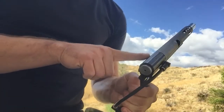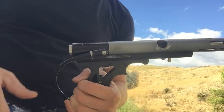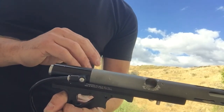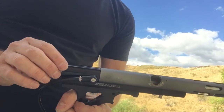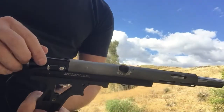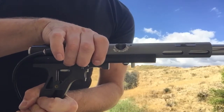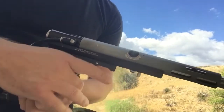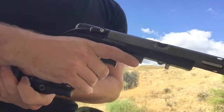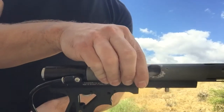What about the bolt tips that protrude inside the inner diameter of the main body? I can grind those to just the right lengths and keep them out of the way of the valve, so the valve is aligned perfectly without any obstructions while still maintaining a good grip between the rail and the main body. This is going to be very important — I'm probably going to put some sort of fore grip on here, so this cannot be wobbly. This needs to be able to take a fall. Multiple screws will likely be necessary to hold this on sufficiently. It's worth doing — it's worth overdoing.